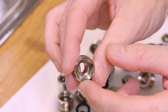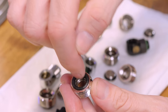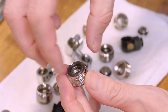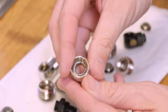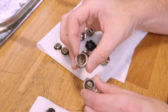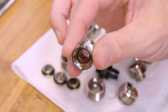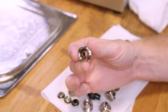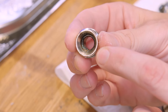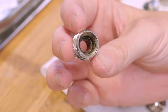Something like this I'm not too worried about. I would still reuse this fitting — these fittings actually seal up here, not down inside. As you tighten the compression fitting it squeezes the O-ring out and that pushes against the tube, so it's only one O-ring that seals it. So I'm not too worried about what's down inside there. But these right here I probably wouldn't reuse. I just don't like how this one has what looks like oxidized copper. This one here started turning black and it's very rough, so there's still some residue — it would take multiple cleanings.